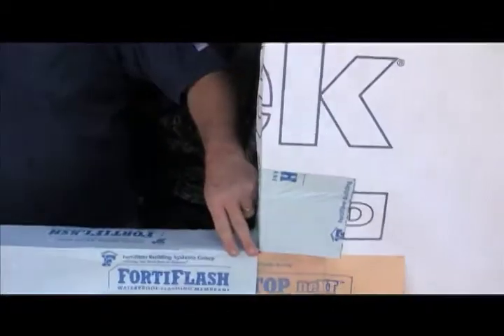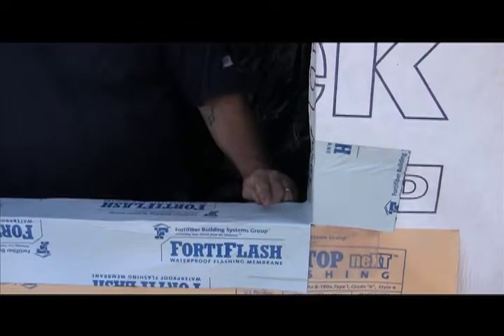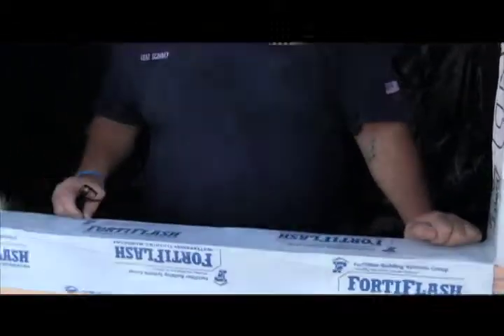You start throwing in slope framing sills and builders' eyes go haywire. But if you want a slope sill, here's a great way to do it. Go get some 7/11 door trim — a couple of inches by half an inch high. Cut the door trim to the dimension of the opening and lay it in place. Then layer some more SAF membrane on top of that. The problem is it decreases your rough opening by the dimension of your door trim — so if it's half an inch, create your rough openings half an inch taller ahead of time. Okay, if that's what you want, that's how to do it.